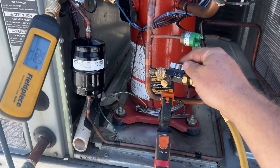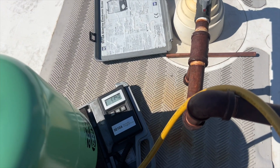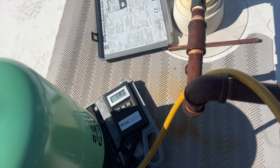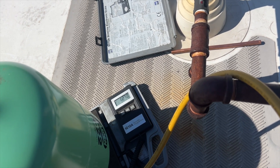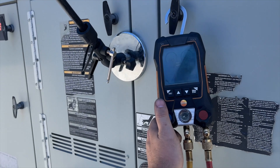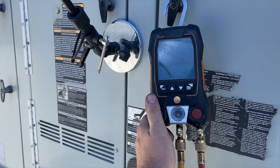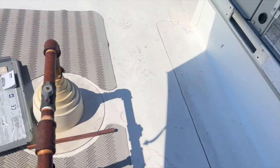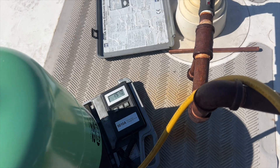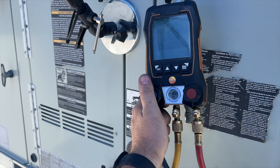I got the unit running. We've got three pounds in there already, so this is an additional one and a quarter pounds right now. I'm shooting for an additional four and three-quarter pounds — about 4.7 pounds. We're already almost at two pounds additional. I was able to get three pounds out of that first tank, so now I'm doing the rest which is 4.7 pounds.